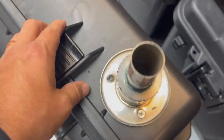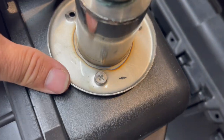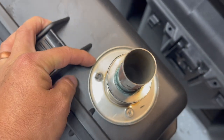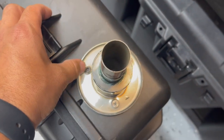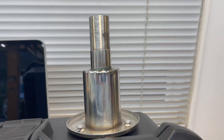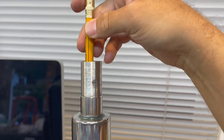For the through-hole, put it on here. In this one I do one bolt at a time - mark the hole, drill it, put a screw in, mark the next hole, drill it, put a screw in, then mark and drill the last hole. The point of this is to make sure the three holes are lined up - you don't want a mismatched hole. Since my Sharpie isn't long enough, I'm going to use a longer pencil to trace a circle.